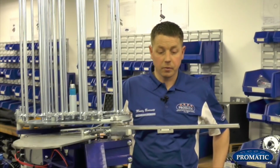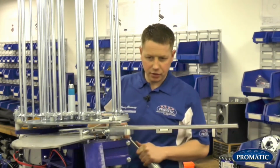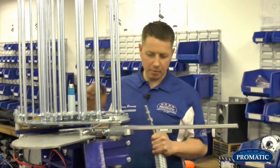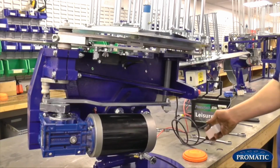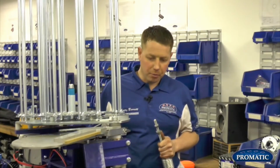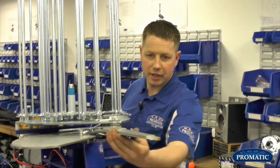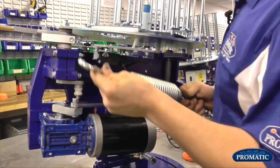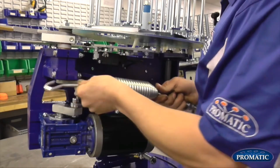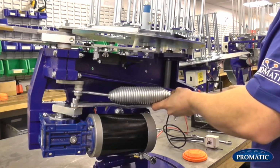So we're now finally putting the trap back together, so the last piece to go on is the spring. When we come to put the spring back on, this is what a lot of people tend to not understand: how to take the spring off correctly, or more importantly, put the actual spring back on. If we nudge this round now, we bring it round there, we bring him back into the 6 o'clock position with the crank, so the arm is sticking straight out towards you. As you can see, it's straight out towards you. So with the hook eye facing in, like so, and not off the back.